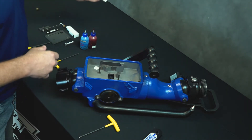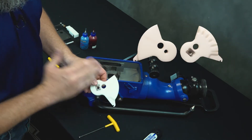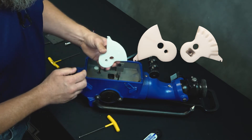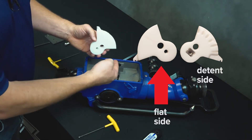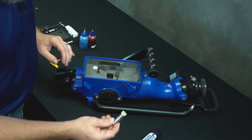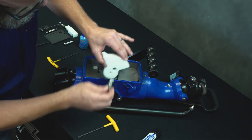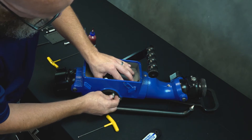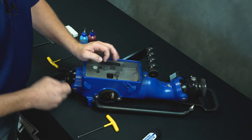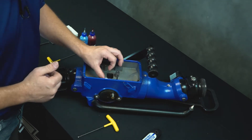The first thing we're going to do is put in the new detent plate. There's a flat side and a groove side — those grooves are the detents that hold the valve in various open positions. There's also a nut pressed into it. When you insert the plate, the flat side should go against the casting and the detents will face inward. Just set that down in there. Now feed the trunnion back through the valve disc through the larger hole to engage this hole, moving things around as needed. Make sure it's pushed all the way in and flush — that tells you the groove in the slider is engaged and everything's sitting where it should be.